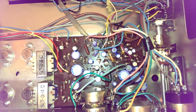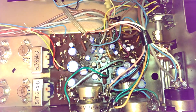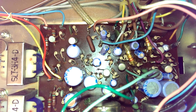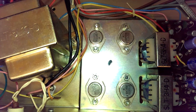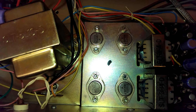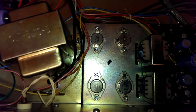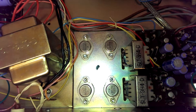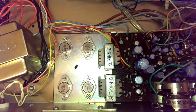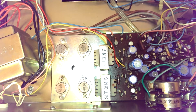The transistors are at least a mix of, if not all, germanium — a mix of silicon and germanium. I suspect the TO-92 packages in black are silicon and the TO-5 metal cans are germanium. All the transistors on the output stage are germanium. They're 2SB473, and I suspected they were germanium because 2SB means PNP, and they're all PNP, so that should immediately tip you off that this is not silicon. The output stage is coupled to the drive stage via transformers, which isn't done anymore but is typical of germanium circuits.